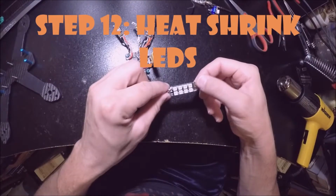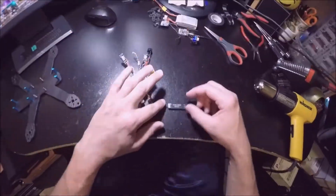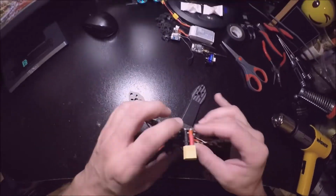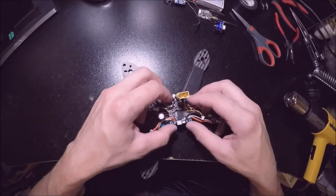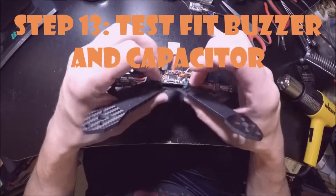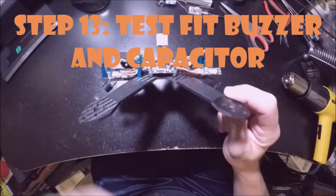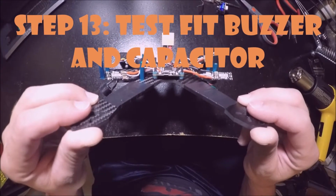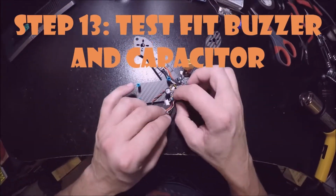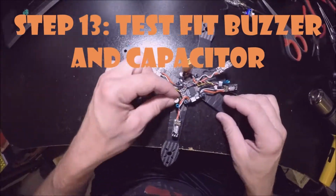For now, I'm actually going to be probably mounting the LEDs just on the bottom of the frame. I don't have a tail light mount or anything like that printed yet, so more than likely I'm just going to be mounting it to the inside of the frame right now. So definitely you don't want the bottom of those pads on the LED coming in contact with the carbon fiber. So just adding some heat shrink to that as well. Obviously using clear heat shrink, so we'll still be able to see the LEDs.